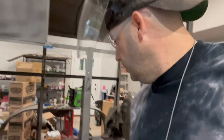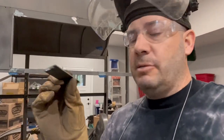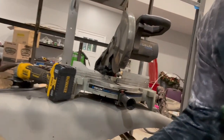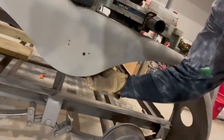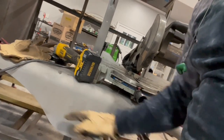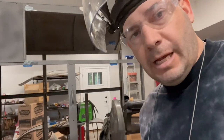So what I'm going to do is I've got some scrap — this is some eighth-inch by one-inch flat bar. I'll make it four inches long, and I'm going to put that behind there. It's going to cover up all those holes and give me a backer to fill all these holes with welds and then grind them down. When it's painted, the finished product, you won't even be able to tell it's there.